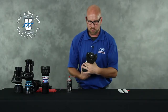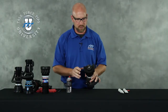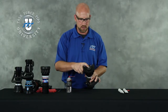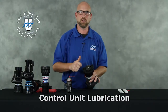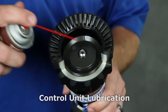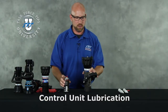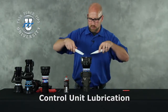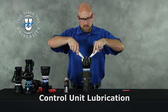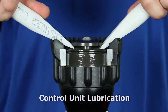Once we've done that, the next thing we want to do is put it in a flush position. On these 50 to 350 handline nozzles that have this silver button head screw, that's open in the center to the control unit. The next thing you want to do is put a generous squirt of that down into the center — that goes directly down into the control unit. Then using your chopsticks, you want to get underneath the baffle and just work that up and down. That helps work the lubrication down into the control unit.